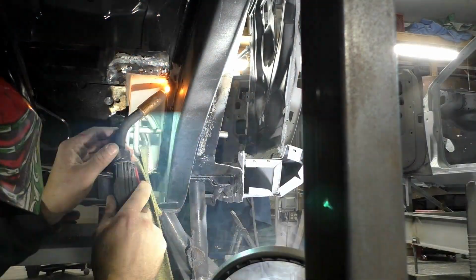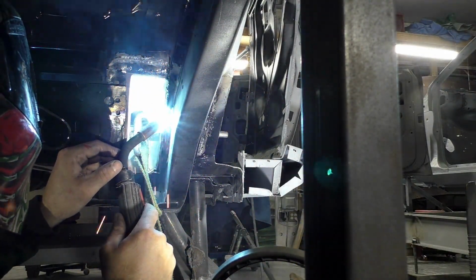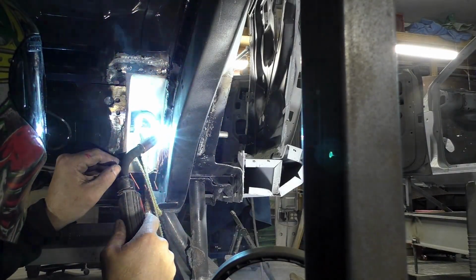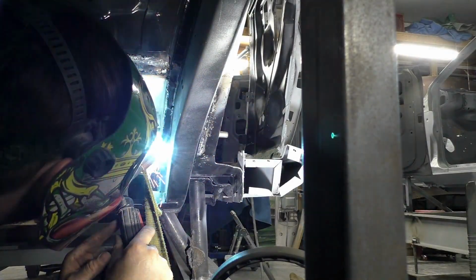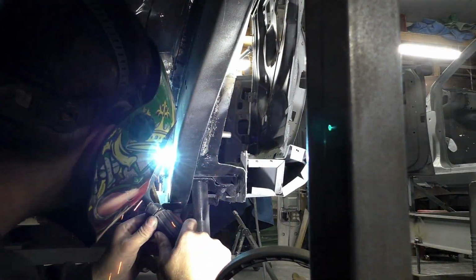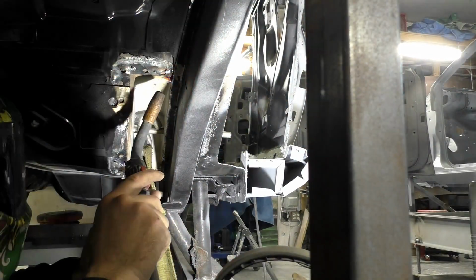Turn our attention to the last bracket. You can see I'm working my way down the frame rail. Same concept. I'm just connecting the frame rail to the inside of the bracket. Between that weld and the inside rosette MIG welds, this bracket, these upper links, I mean, this car can have a ton of horsepower, and I'm not really worried about breaking them.